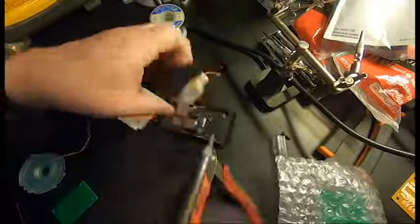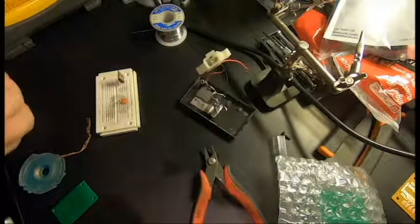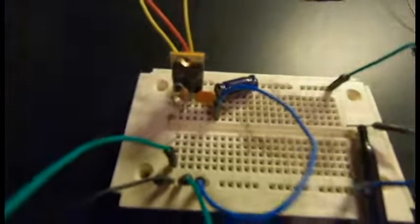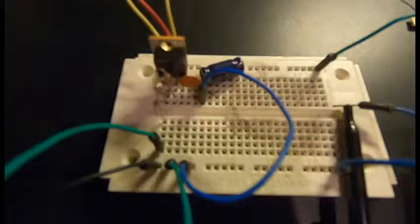So I'm going to pull this out of here, and the capacitors are still what I want. This is set up for like 6.3 volts or something, so I need to vary some of these resistor values to get it down to 5 volts output. Pretty simple little circuit. I just made the dumb mistake of reversing those two resistors, and that confused me for a while. But yeah, now this is working, and we can start wiring up the 555.